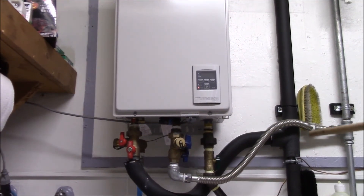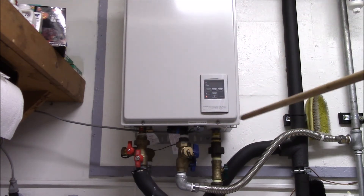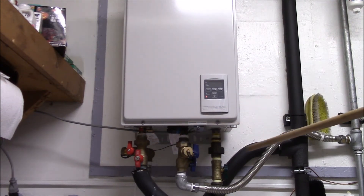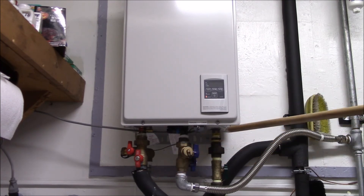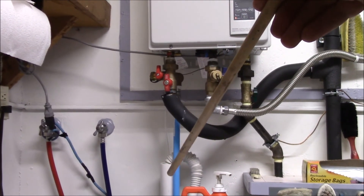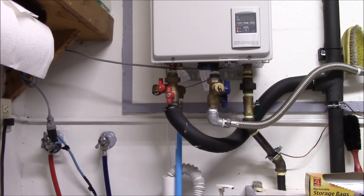For the water I decided to use flexible stainless steel hose. The thinking was to use flexible hose so that if I ever had to change this heater out in maybe 10 years and can't get the exact same model, and the water connections are in a slightly different position, I should be able to handle that. For the gas I can just move the pipe in or out to shift position, so that's easy to deal with. Water was pretty straightforward — just hook up two hoses. As for the condensate drain, there's the standpipe for the clothes washer right there, and the output of the drain was just a straight shot down. The clear PVC tubing I used seems adequate — it flows condensate, hasn't degraded, hasn't plugged up. That works fine.